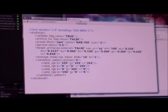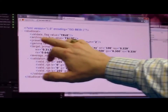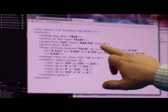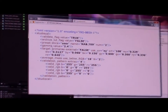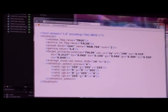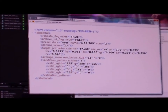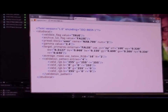The file is called StudioCal.xml and it gives the ability to use an HP-created calibration schema. I can tell it to validate after calibration, choose to archive the lookup tables — which it writes back to the flash drive after calculations. I specify where to store it, what to name it, the gamma, the primaries including X, Y or UV color, luminance values, measurement averaging — useful if the instrument isn't as accurate at low black levels, like the X-Rite i1Display. I can also set up validations.